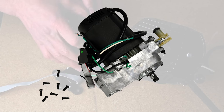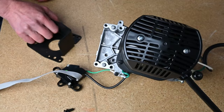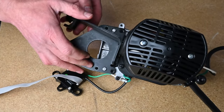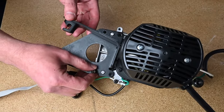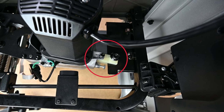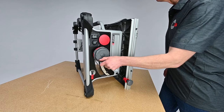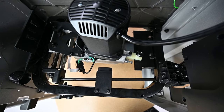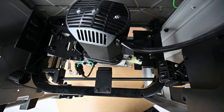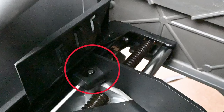Installing the new motor. Remove all packaging from the replacement motor. Attaching the retraction bracket: using a 4mm Allen wrench, attach the retraction bracket to the motor housing using the 4 matching 16mm bolts. Next, align the remaining hole in the retraction bracket with the threaded hole in the carriage block and install the last shorter bolt using a 5mm Allen wrench. Take care to straddle the slot in the alignment block over the guide fin. Rotate the elevation adjustment to drop the blade to its lowest position. Toward the bottom of the range of travel you'll feel some resistance, but continue to lower the assembly until the black hook-shaped hardware on the retraction block re-engages with the silver metal pin. The retraction bracket installation is now complete.